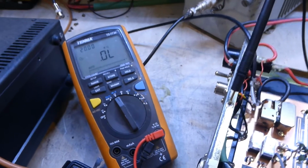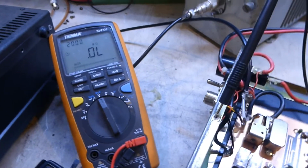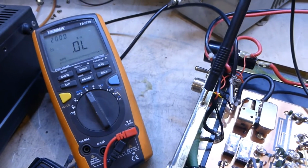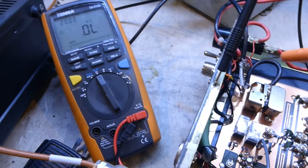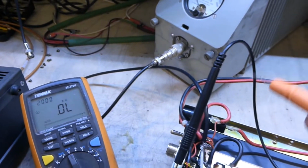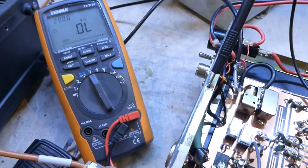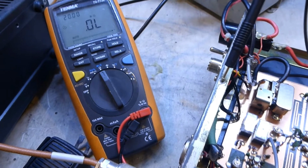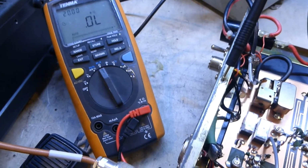Right, so we've got the larger power pack on now, so there's ample current and the unit trips straight away. So we're continuing on. What I did is I bypassed that socket. I've actually wired this cable, which is going directly into the dummy load. And what I've noticed is on the drive radio, the VSWR is infinite, it's high.